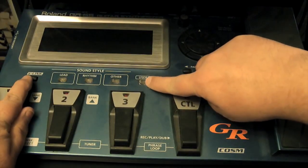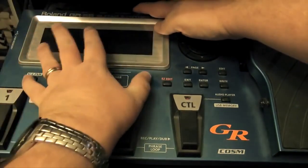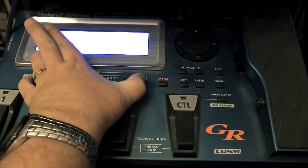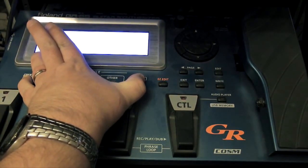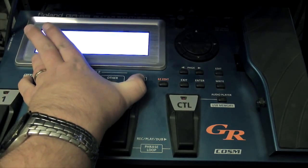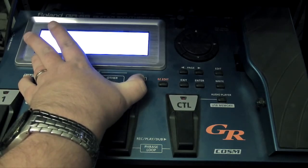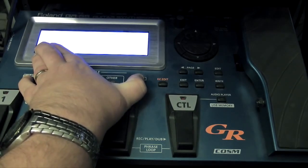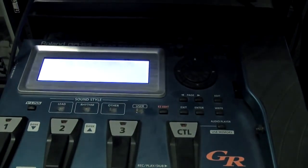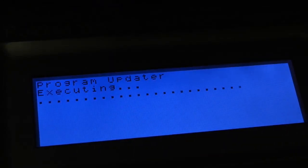Make sure it's snug and then close it up. Now we need to reboot and start the process. For this you need to be a bit of an octopus — you've got to hold the V-Link button and the User button down at the same time. I tend to do it with a big hand like this: V-Link, User button, and then power it on. It'll take a little while for the process to begin, but don't panic — just keep those buttons pressed down. Whatever you do, don't turn the power off. Same with any firmware update: always make sure the power stays on.